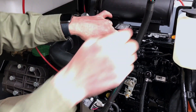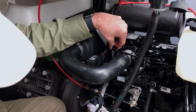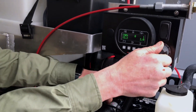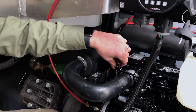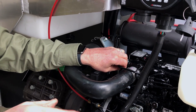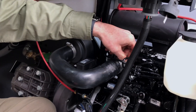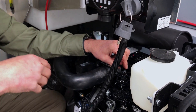After you do that, you want to turn the key to the on position and loosen the bolt on the injector. Let it sit there a little bit and then try to turn your key — you'll see fuel come out and it'll spit and hiss. You don't want to really leave your engine running; you just want to try to start it. Once that happens, bleed that one and tighten that bolt back down really good. Take the same approach on the next one — loosen it until it's very loose, turn the key and do the same thing. It'll spit and spurt.